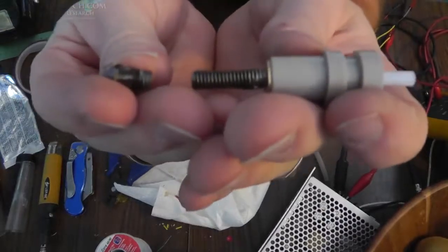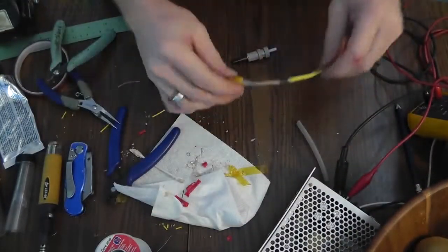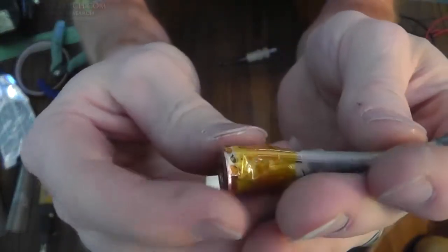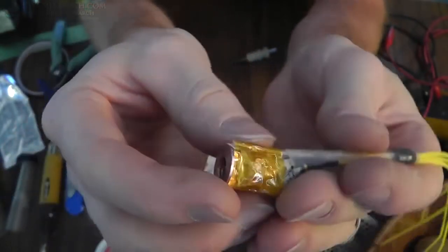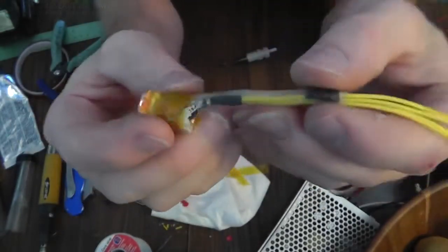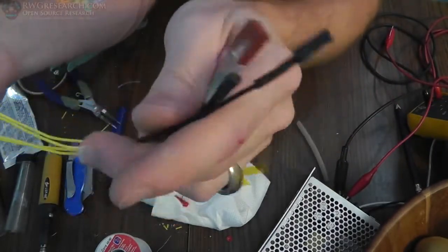Alright everybody, so here we are. I've taken these two pieces off. Not necessary to show you the final heating element. So this is the heating element. Thermistor is right in this block right here, which is exactly where we want it to be, deep down inside there. Heat shrunk everything so it doesn't really move around. I can still unthread it and put it on a new unit, and then I've soldered on the ends.